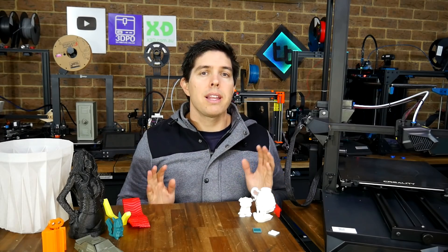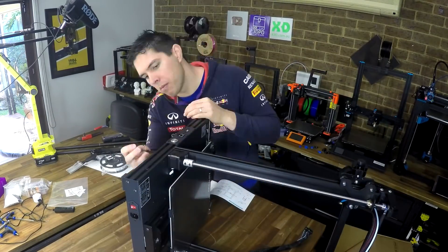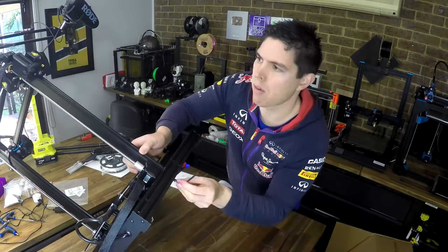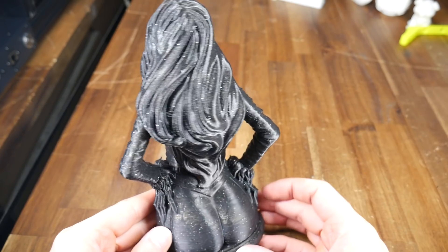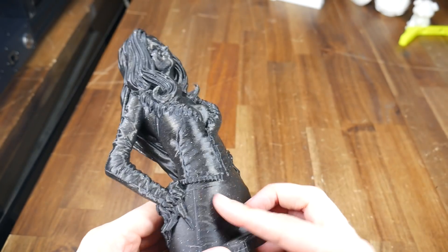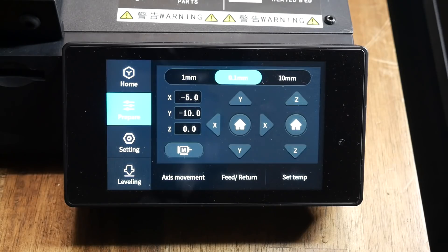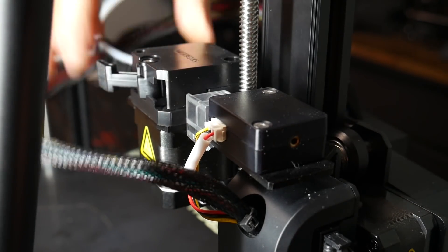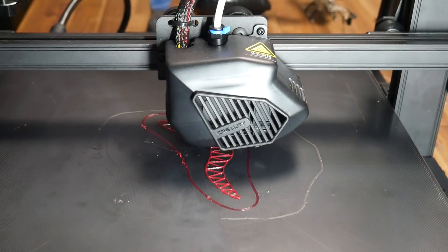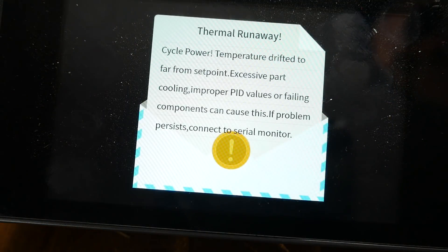So let's summarise some strengths and weaknesses. This printer has a lot of problems, but we need to be fair and identify its strengths. Assembly was pretty straightforward. The provided slicer and inbuilt slicing profiles were easy to use, and ultimately the print quality on the majority of models was quite reasonable — the profiles just need a little tweaking to dial in retraction. The touchscreen interface does a good job, models generally stuck well to the glass bed and self-released once cooled, and I have no complaints about the extruder. I was also pleased to confirm the printer ships with working thermal runaway protection.